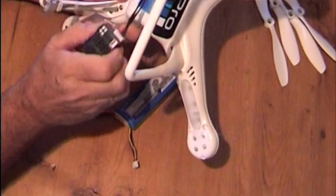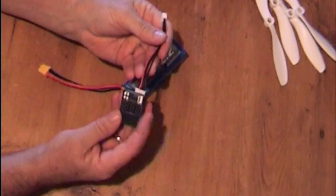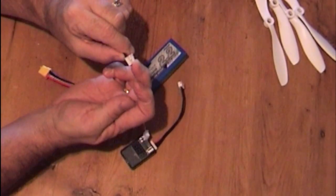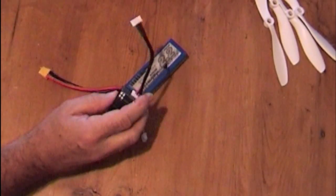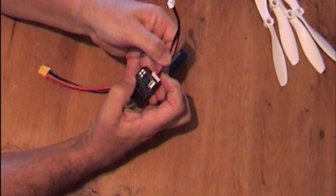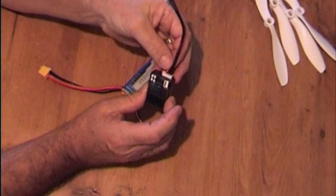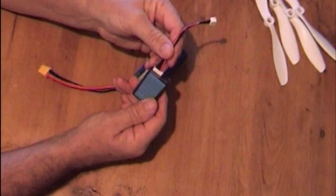You can see the light flashing — I'll just switch that on now to show you how it works. And then this lead here, you can buy from Hobby King as well — it doesn't come with this. When you get one of these leads, what you need to do is cut that little tag off, just get a Stanley knife and cut it off. Here's your lead with the modification done, the little tag's cut off. Now if you look carefully, what I've done is marked the minus and plus. I know the minus is on this side because that's where it's got to go, but the red is in line with the plus there, so you can tell which way it is — because if it's the other way up, you're going to get the lead the wrong side.